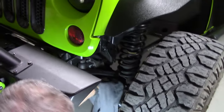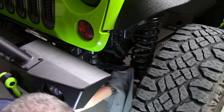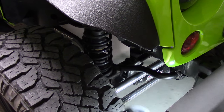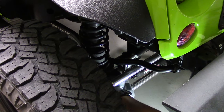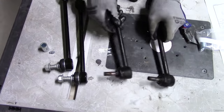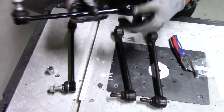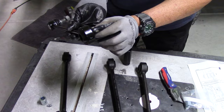Wipe off the connection on the top and the one on the bottom. You can see how easy it is because I have the quick disconnect. Let's go to the other side and give that a nice clean wipe, and then get the quick disconnect as well. Here's the old — you can see how worn out they are. And here's the nice new bushings, top and bottom, and a hole for the Zerk fitting so you can lube it.